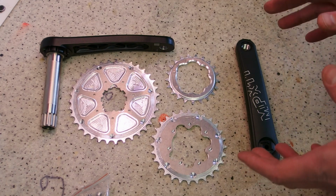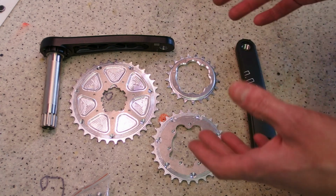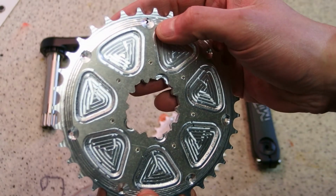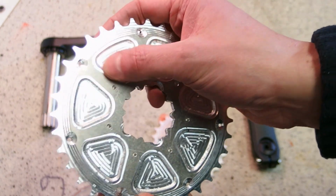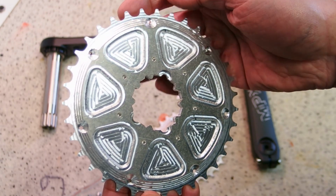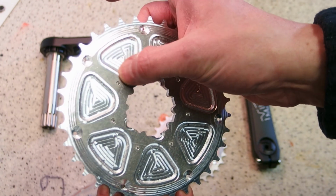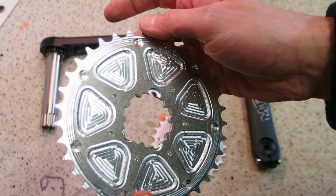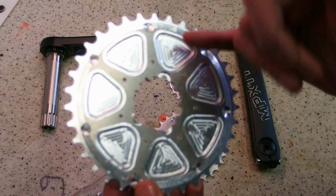So, what do I need to do on each of the chainrings in order to finish everything and get something usable? On each of them, I need to deburr everything, because my programming isn't great, and also isn't terrible. It could have been worse. It certainly has been worse on some of the things I made. Anyway, I need to deburr and smooth everything because some of the cuts aren't really clean. Then I need to punch every hole which needs to be punched through.